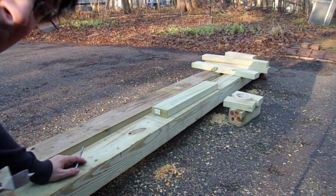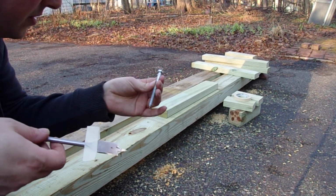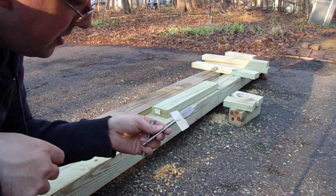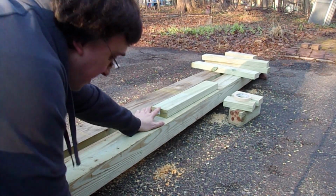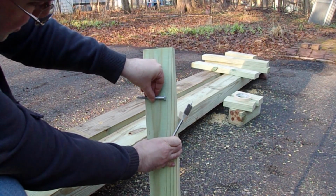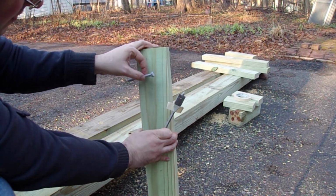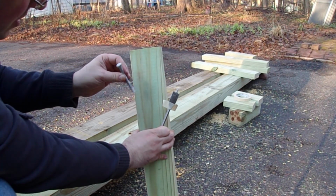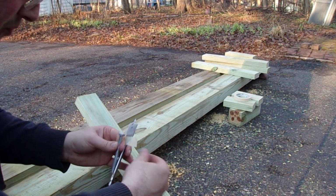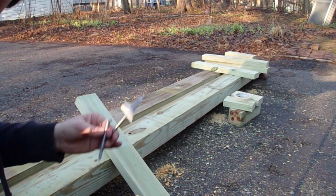Alright, so only really two more things we got to drill today. One of those is for the tack boards, where we're using a 5/16 inch bolt or screw that's going to have a 7/8 inch washer on it. And so I got my 7/8 inch bit, and it's got to get sunk in here because this tack board, the way this is assembled, the screw has to sit like here in order for it to stick into the side of this main board here. And so it's sunk about an inch below the surface. Again, kind of for safety reasons and for lack of access, but it's a little bit of a pain to get out too, because if you don't make the hole big enough, you can't get a socket in there. So we'll start with this size hole, and if I need to make a bigger hole for the socket, actually let's measure the socket and make sure that's the right size, and then use the right bit for that.